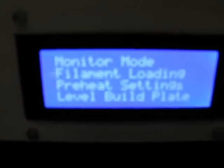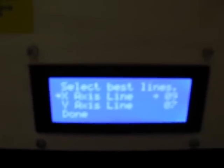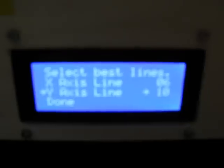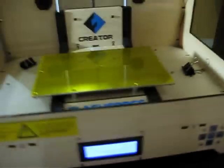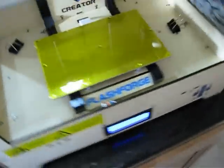So I'm going to put those values in. We're going to go to Utilities, Calibrate Nozzles. X axis line — I said six. Then Y — it's ten. I would assume you guys are probably close to that. Y is ten. I'm going to shut this thing down, restart it, just make sure those values are saved, and then we'll print a leveling script.